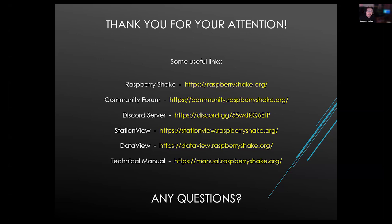In 2010, there was a very strong earthquake in Haiti that unfortunately generated lots of casualties, but it gave us the example of a geophone saturating. That is, a geophone can detect movement from zero up to a certain threshold. The threshold is not a constant because it depends on where the shake is installed and how the bedrock and the foundations behind it are structured. Beyond that limit, the geophone will just display a flat output because the movement is so intense that it cannot keep track of it.